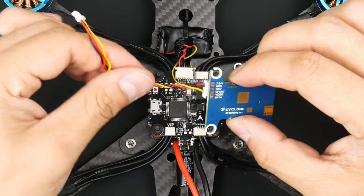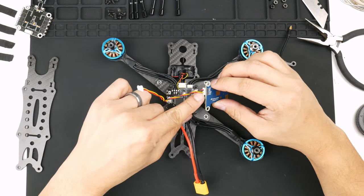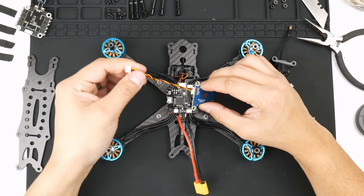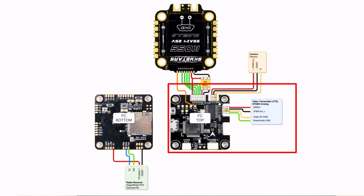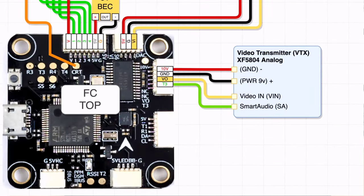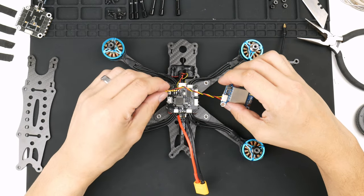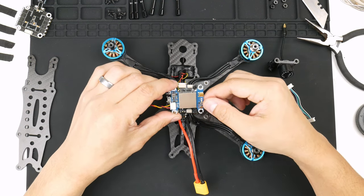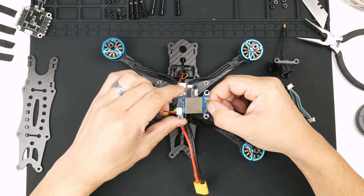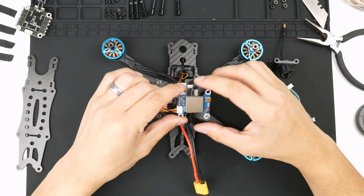I'm going to reuse the wire harness — the data line will just be a plug I'm adding in. On the flight controller side it will be T3, the transmit pin of UART 3. Not sure why they didn't do that in the first place — maybe they couldn't get it working. If it doesn't work, we'll have to configure the video transmitter using manual mode, which is a series of button sequences and LED flashes. I'll link the instructions in the description below.